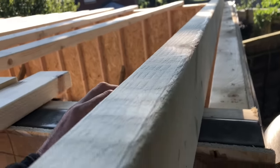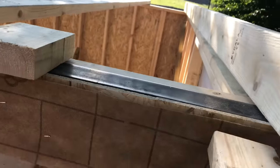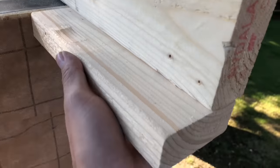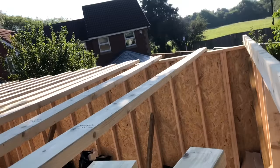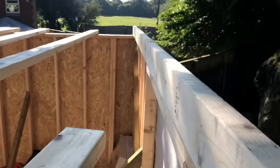The first timber needs to be in line with that wall so the outside edge aligns with the edge of the wall — that gives you something to screw plasterboard to. I've looked down the timber and there's a slight bow, so you put that bow upright. That way you won't get any pooling; if you took it the other way the bow goes down and you risk water pooling. I'll fix one at each end, put a string line on, then put all the other roof joists up to the string line.